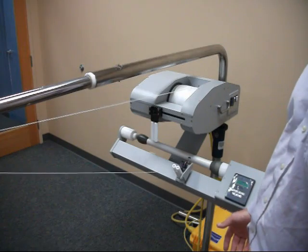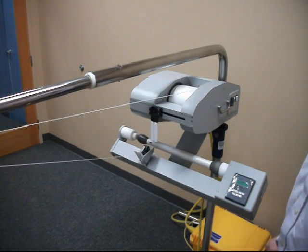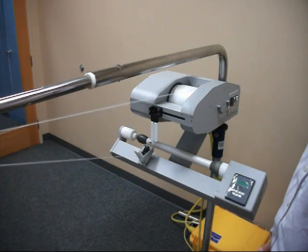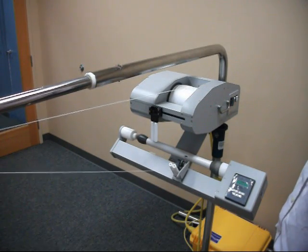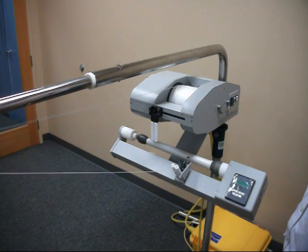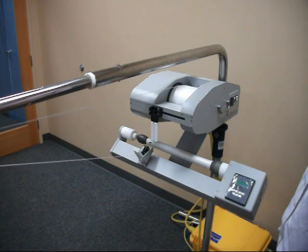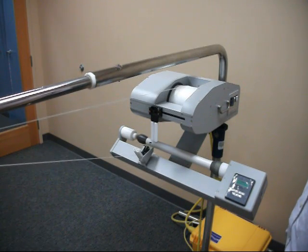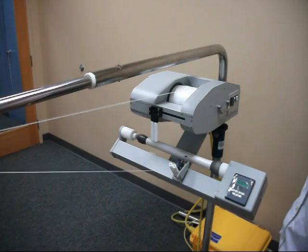This may be a condition where the winch has been used for some time and no checks have been made, and the clutch has loosened somewhat over time, which will happen, and led to the rewinder tension being too low. So it's always a good idea to check this periodically, certainly before leaving for every cruise.